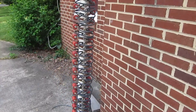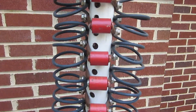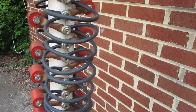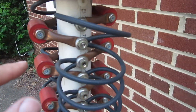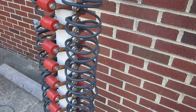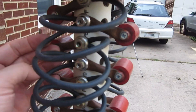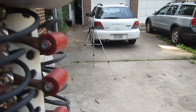I found out that if you use normal resistors — I was doing smaller Marx generators — they will arc across them because they have a small radius. If you have a larger, smoother radius, then you can get a higher voltage. What these things are here are radiator hose tubing. I actually took my digital ohmmeter to the auto parts store. I think they were about a megaohm per centimeter or something like that. Of course, you don't want them touching each other.